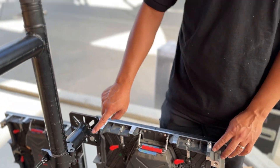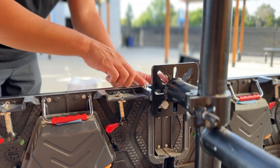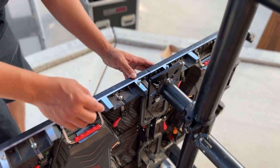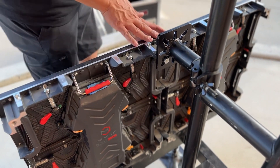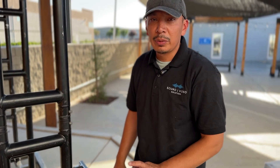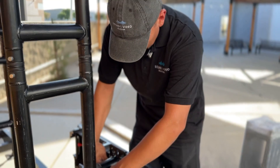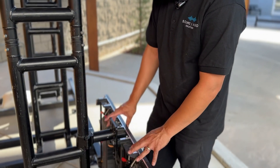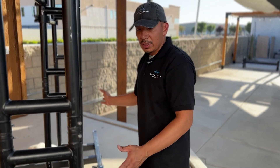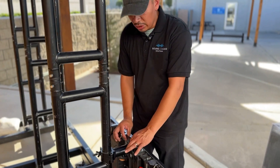I would say about a quarter inch of where you're going to be. And as always, on your first row — your first row is going to make up the rest of the panel — so you want to make sure the top is going to be as flush as possible. Once you have those in place, go ahead and lock them in from the back. Just to reiterate, these screws and the bolts in the back, you want them to not be super tight. You want them to be about one-eighth inch away from the plate — enough to give it stability and enough for it to be ready for the next panels. As you do your first row and second row, you're going to notice that this has a little bit of playroom. Keep this loose as well until the very end so that you can get all your bolts in there.